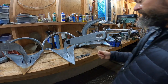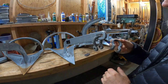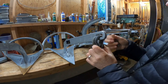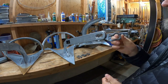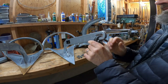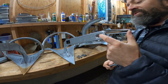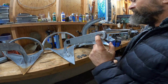Here's the 45-pound Mantis anchor. The half-inch shackle passes through. Here's a 7/16ths shackle — that passes through. It's a nice big opening. The 3/8ths, no problem. And the little 5/16ths, no problem. So, like the Delta, it'll pass all four shackles in the normal manner, but in addition it's got a chamfered edge. So far, this is the best chain attachment I've seen.